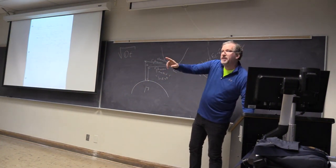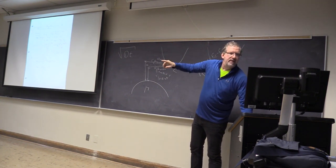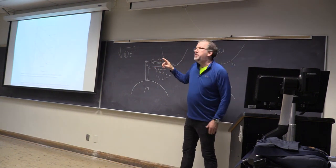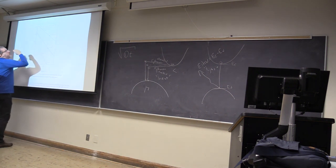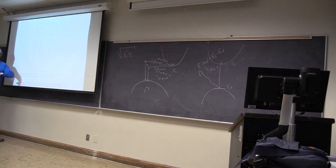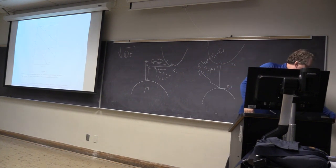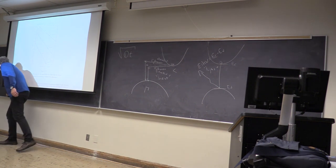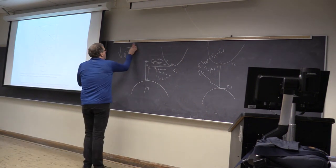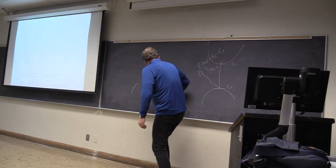And temperature dependence. So here's the temperature dependence of N sub I, showing the intrinsic carrier concentration. So now you see the temperature dependence of them, and so the hotter it gets, the more carriers jump the forbidden band gap. Right. So I don't think I've ever explicitly drawn this, but let me do it this time. I just want to make this painfully clear, so if you gap on the exam, it's not my fault.